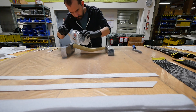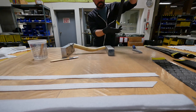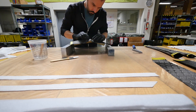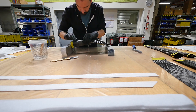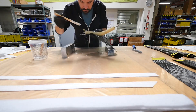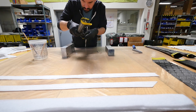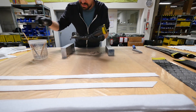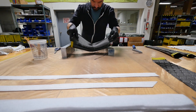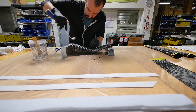To start off I'm applying a pretty thick layer of epoxy — just kind of pouring it on and spreading it. I want it really thick to make sure there are no air bubbles or voids and to help the carbon stick to the mandrel. I'm having a really difficult time getting the edges to stick down. The material just doesn't want to conform to this tight small radius, so I'm applying another layer hoping that'll help.